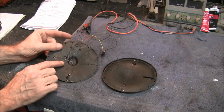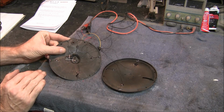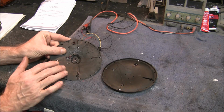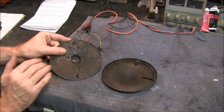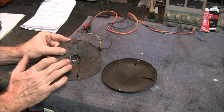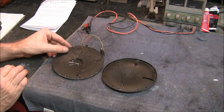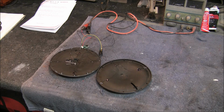This light here, this 3mm that we're going to have lighting the bridge, that'll just connect to the power. So we'll have power coming up to the board, our 9 volts, and we'll just tap into that. So whenever we turn the power on, that light will also come on. We have to connect a 470 ohm resistor onto that to make sure we don't blow it out. But that's it, guys. So that's our basic navigation and strobe light on the saucer.